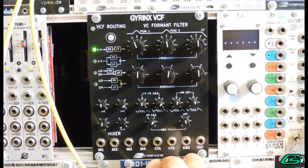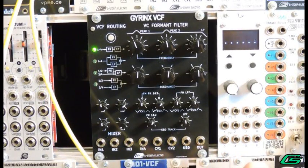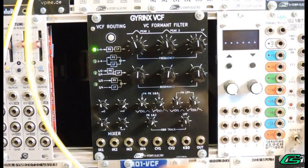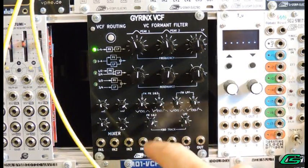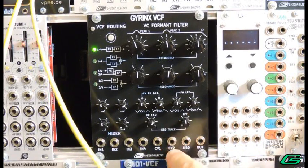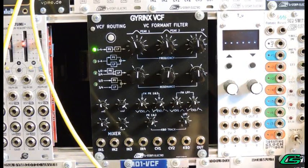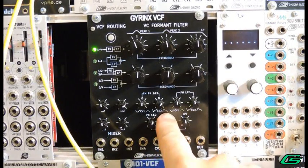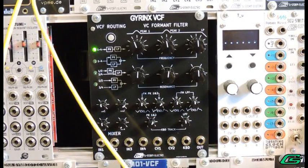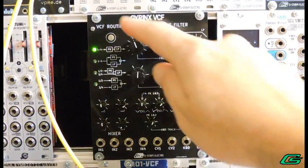Down at the bottom there are three CV input jacks: CV1, CV2, and keyboard. These CV signals go to each of the filter types, so the peak filter has its own set of pots as well as the low-pass filter. What makes this interesting is CV1 and CV2 have the ability to invert the incoming CV signal. For example, a positive-going envelope signal can be used to decrease the filter cutoff.